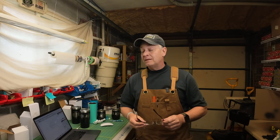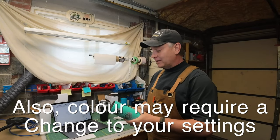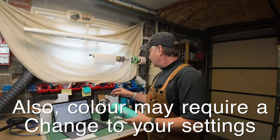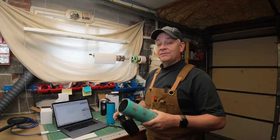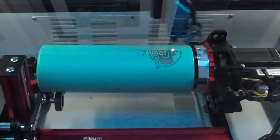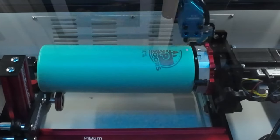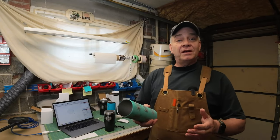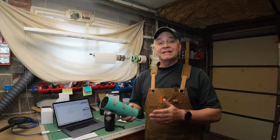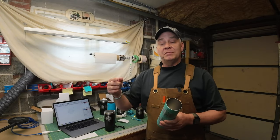I also increased my LPI. Another point: powder-coated tumblers are not created equal. Depending on the manufacturer, the powder coat may be thicker or thinner. I noticed the teal tumbler was flaring up a lot during engraving, whereas Polar Camels, Yetis, and no-names don't. So the settings for one manufacturer may not work for another — you may want to make separate library entries based on manufacturer.